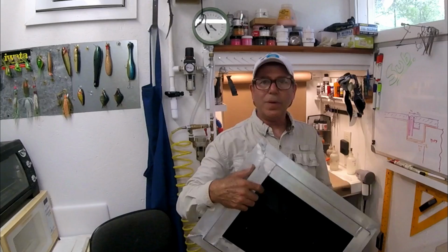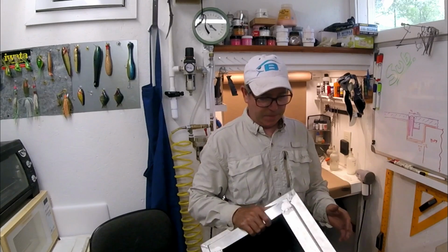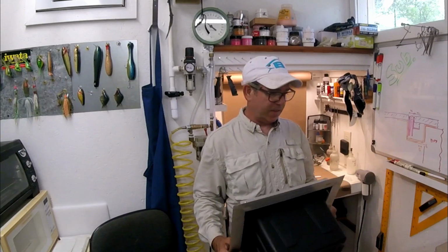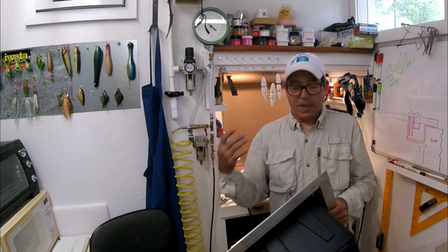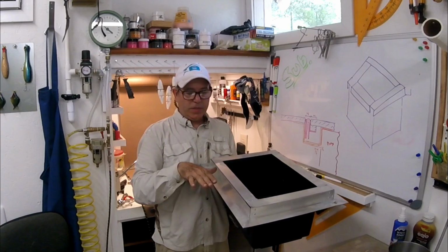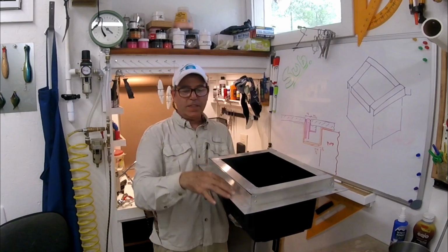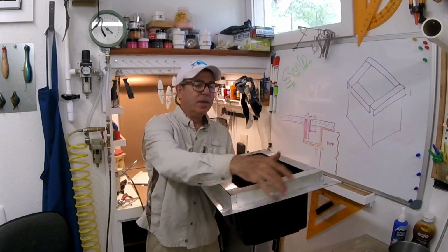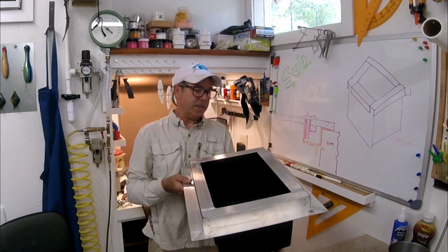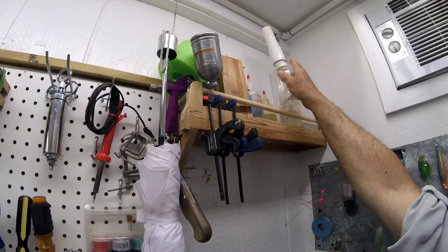That's what that is. Really, the design was the toughest part for me. Just coming up with a good way to do this in a way that I was capable of doing, because I'm not much for weld. Well, I'm not set up to weld aluminum, but the seam where the hatch connects with the deck will be over this channel. So when it rains, it'll fall into this channel, and then I'll put a couple of drain tubes on the downhill side, on the stern side of this hatch. Been a total of 4 days.